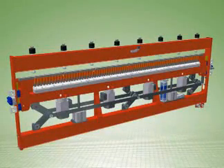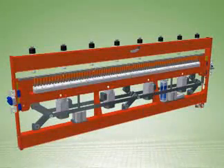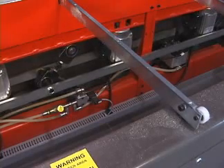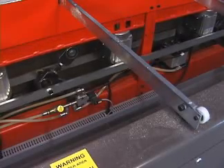A CAD drawing shows the design detail of the aggregate. The main support is a four-sided frame. The four 19-spindle drill heads and motors are mounted to the frame by linear bearings, which facilitate up and down travel of the boring stroke. Lift for the drill heads is by a combination of pneumatic and hydraulic power. The lifting scissors assembly includes two steel bars to form a torsion effect, keeping the drill head unit perfectly straight during the boring cycle.